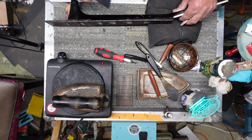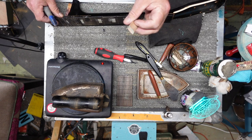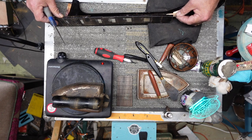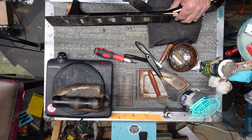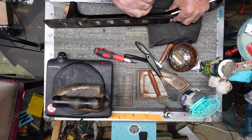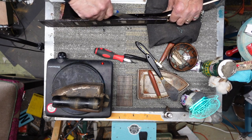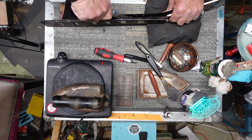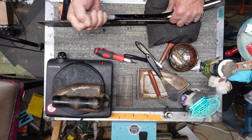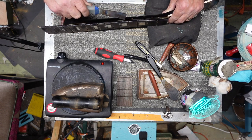Okay, so we've flipped this over now to make sure that the other side isn't splitting out. I've got this little tab that I use when I'm separating a body from the kerfing, a part of the body, the back or the front, and I can just put that in there to give myself some room. And then as we go down, again, we're just rocking this back and forth, and we're making sure that we define the cut line as we walk down with the edge of the knife. If you don't do that, it's going to break out on you, guaranteed. There we go.